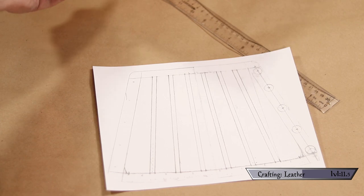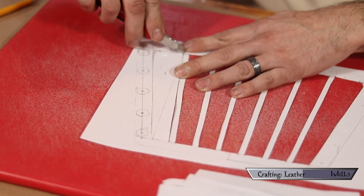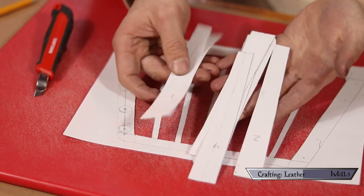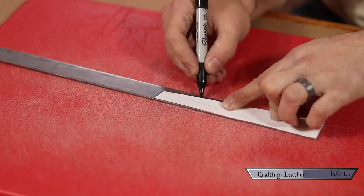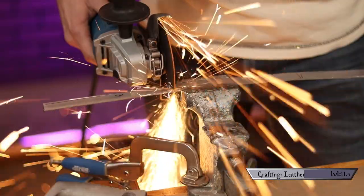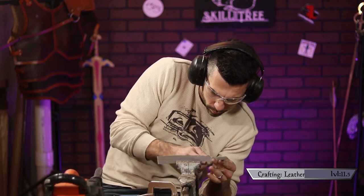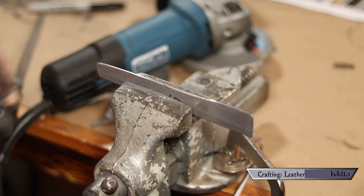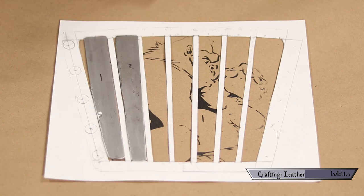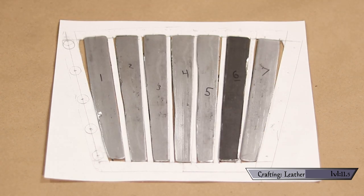I want to use those shapes I just drew as the template for my metal. To that end, I made photocopies so as not to destroy the original template and started cutting. Remember to number them so you know where they go. Next, I drew the shapes onto my metal, numbering them as well. Then I got to cutting and grinding each into shape, finishing up by rounding off any sharp edges or corners that might dig into my leather. Double-check your work to make sure everything will fit — a bit smaller is better than too big.